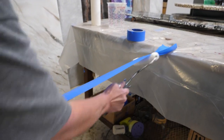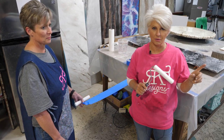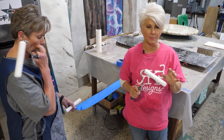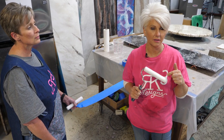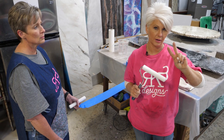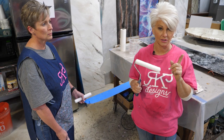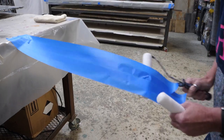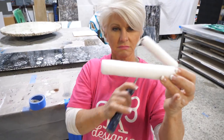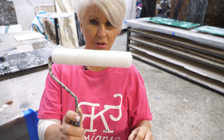So what we're going to do, we're going to prepare to pour our ultimate top coat. This is the first thing I do before I mix up any of my products — I'm going to prep a wet roller. For every one wet roller that I prepare, we're going to prep two dry rollers. What I mean by prep is we're going to shed them. The best way to shed them is to run them over some kind of tape. The unprepped roller still looks kind of fuzzy, but a prepped roller looks like a scared cat.